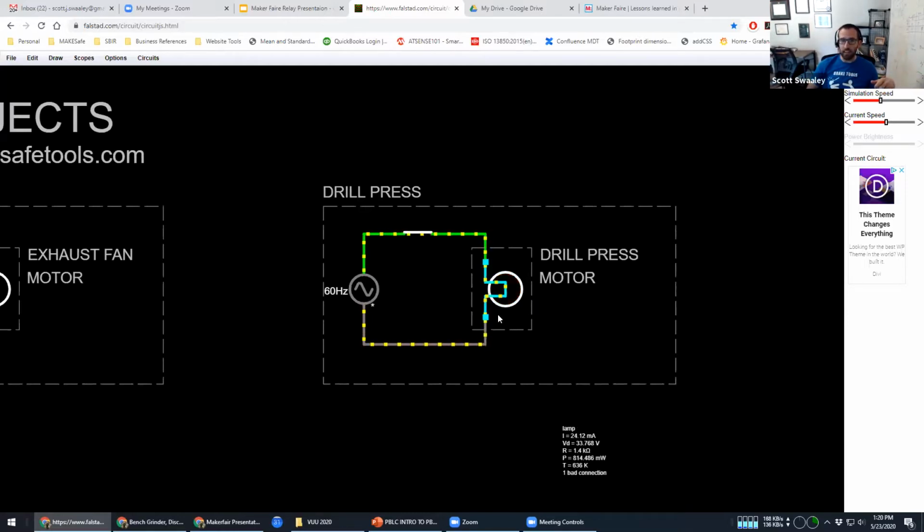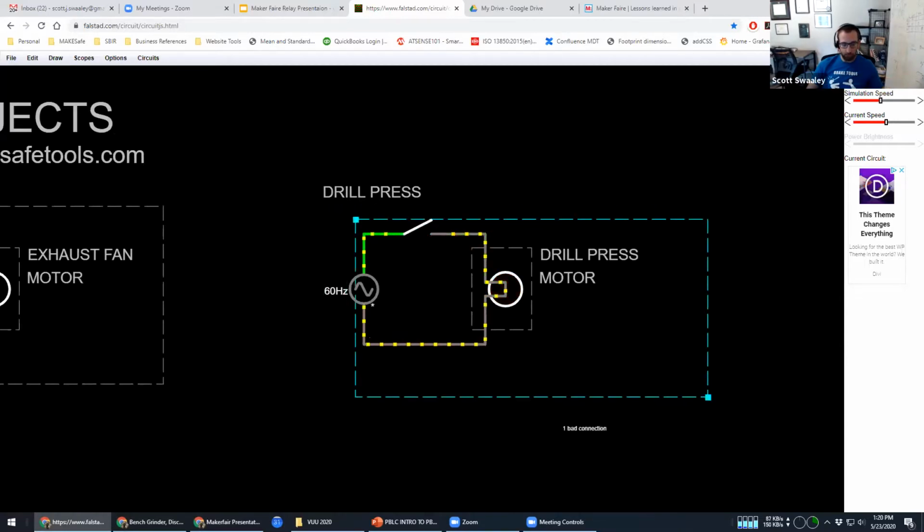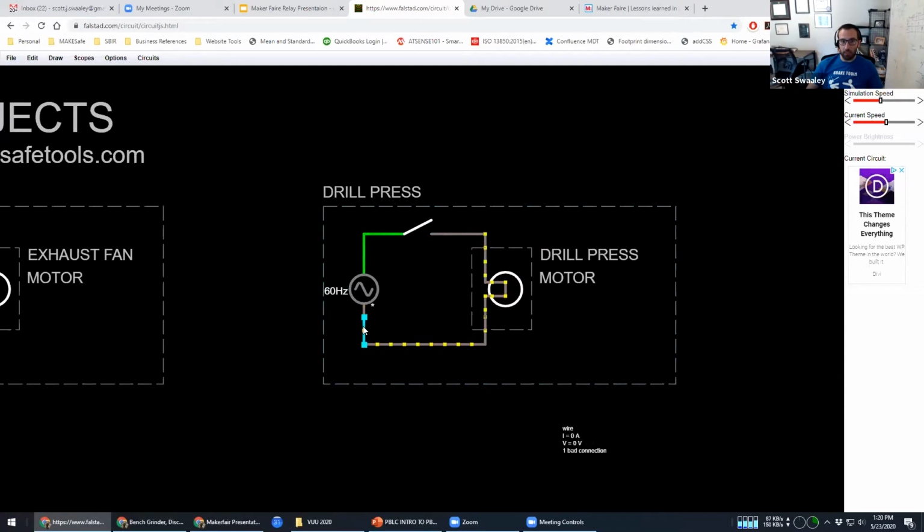Or let's say that when you're rolling the saw outside, it's obviously unplugged, right? While you're rolling it, someone accidentally presses that switch. And then while somebody's setting up their work, somebody plugs it in. Guess what? Your bandsaw just turned on, and someone's hands were probably not where they should be. So this is actually called an accidental restart.